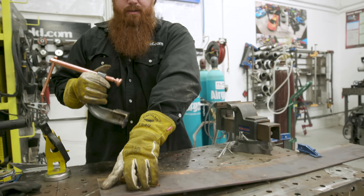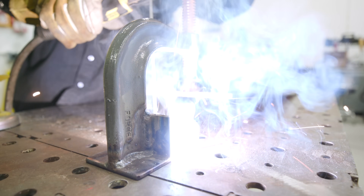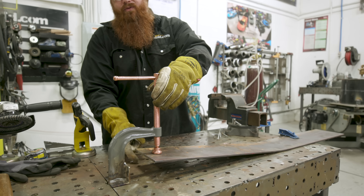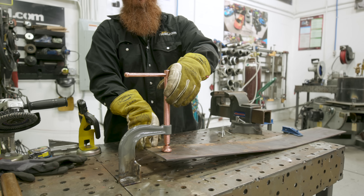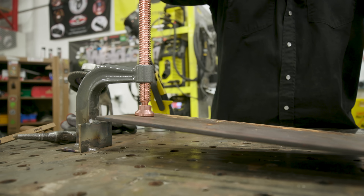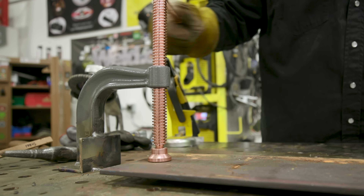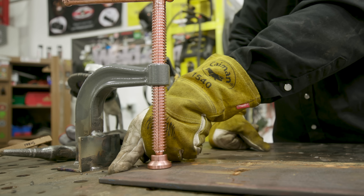As you can see here, we have a little mocked-up piece to simulate — plate doesn't always come in straight. So what you would do is weld this side to the deck right here, and we're not going to weld all the way around — just on this side, and I'll show you why. What that's going to allow me to do is drive this piece of metal down flush and flat, almost like a plate dog, but with a little bit more force. I'll be able to align this plate with another plate and weld that up, or just push this into position where I need it. You don't need much weld there — I only have about three-quarters of an inch, and I have it on this side because the pressure is going to be going in the opposite direction, so I want to hold this end down. If I weld it back here, it's going to break. So that's a quarter-inch plate right there — that would hold it down. Now I'm back to flush and could go ahead and weld this in wherever I need to.